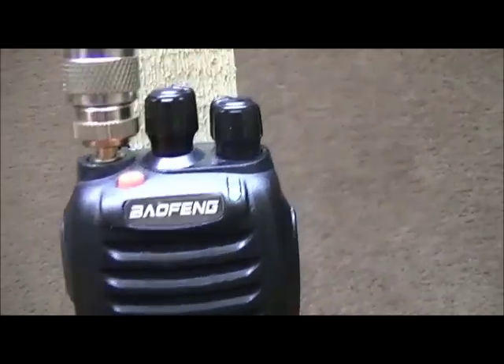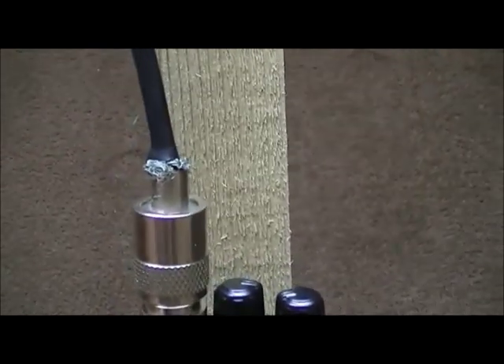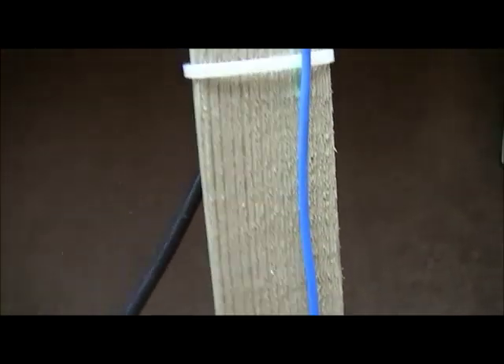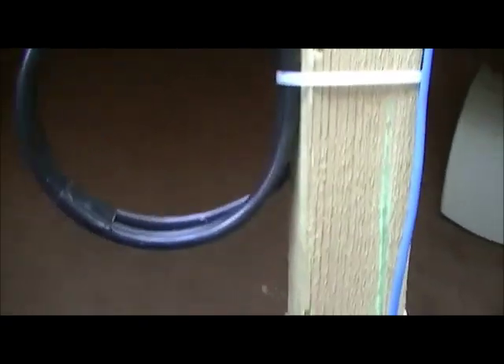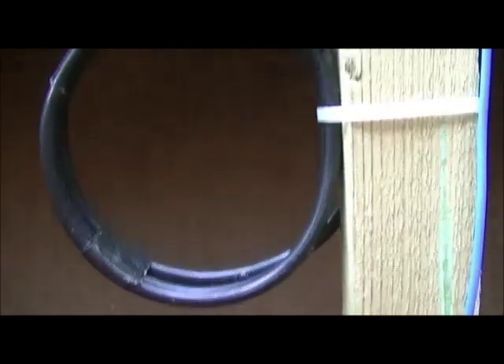This connects into the radio. I've just done it myself as a bit of an experiment, so I haven't taken much care. Going up — that is one end of the dipole, the base end, just cable-tied onto the wood. The coax goes up, and here we have a balun, wrapped round about three times. I'm not sure of the diameter — maybe five inches or something like that.